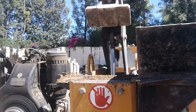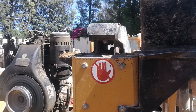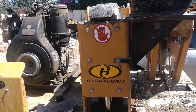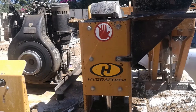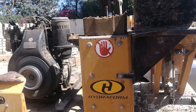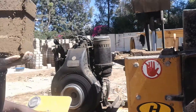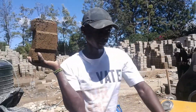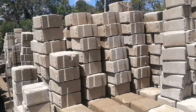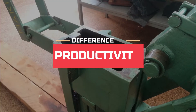The soil mix is loaded inside a hopper at the top. Once full, the soil mix is slid into the compression chamber. The operator then closes the top lid and lifts the bottom hydraulic cylinder. The top lid and the rising hydraulic cylinder provide the compression force needed to make an ISSB. Once full compression is achieved, he lifts the top lid and pushes the ISSB out of the compression chamber using the hydraulic cylinder. The block is then transported to an area where it will be left to cure.